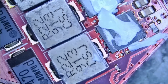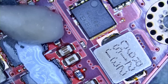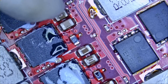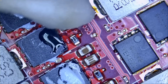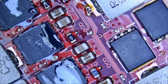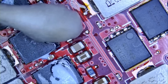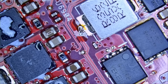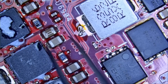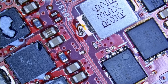I'm injecting voltage right now, and I'm just going to put some alcohol here, here, here. Look — right there. Look at the cap, how alcohol is evaporating first because it's heating up. We got the bad guy. You see how we still have alcohol on this cap, but not on this one? The problem is this guy right here. Say hello to the bad guy.